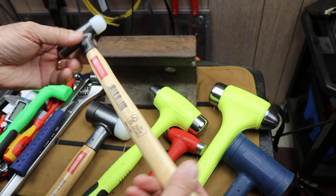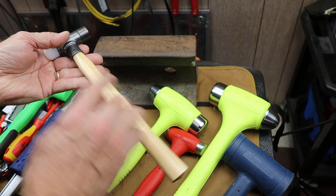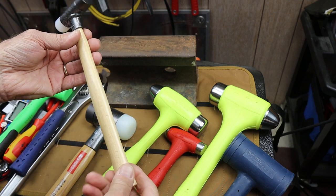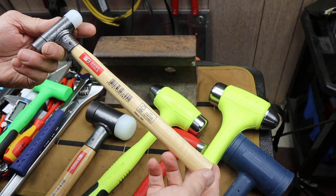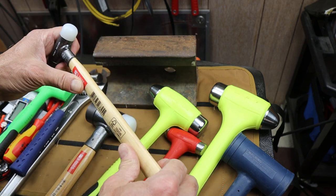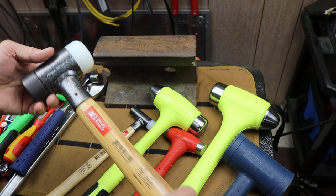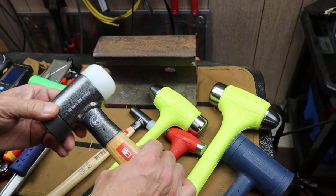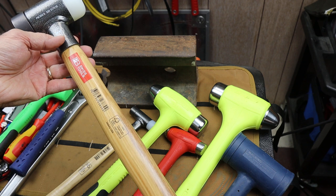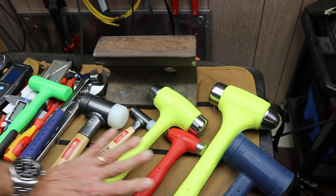The type of wood used on a handle has to do with a couple of things. Obviously, you want a hardwood for durability, but sometimes there's shock transmission, and sometimes there's flexibility. Hickory, like on axe handles, is more for reducing the shock that's transmitted straight through versus flexibility. There are lots of choices of hardwoods depending on whether it's a hardcore striking tool, a chopping tool, or any other kind of tool. Hickory is often chosen for heavier duty striking tools. Anyway, that's not where I wanted to go.